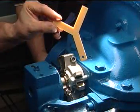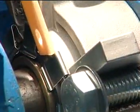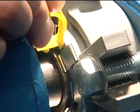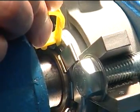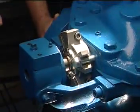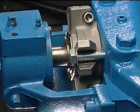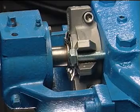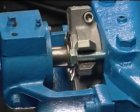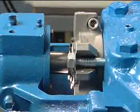To check the seal for correct rotary placement, insert the Y spacer or back of the P spacer against the back of the gland. The width of the spacer should be approximately flush with the back of the stationary. This comparison can also be used as a seal face wear indicator during operation of the seal. Rotate the shaft by hand to make sure that there is no metal to metal contact within the seal. A slight drag may be found due to the seal faces, but the shaft should rotate freely. Take all necessary precautions and follow normal safety procedures before starting the equipment.